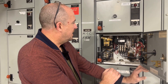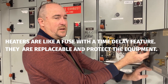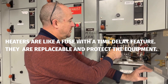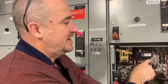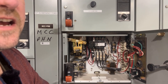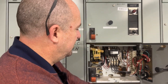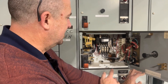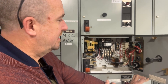These heaters are replaceable and they're there for safety. This is the reset, which is the plunger on the outside that we just looked at — basically as you push it, it pushes this button. Here is your coil, or what's called your contactor coil, and this contactor goes in and out. Our transformer gives us step-down current — in this case from 480 volts three-phase — and takes one of those phases to make 24 volts control voltage.